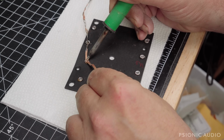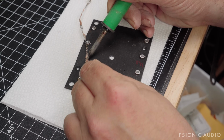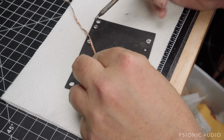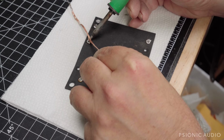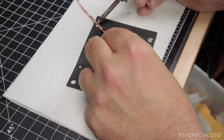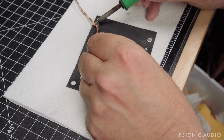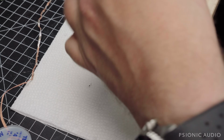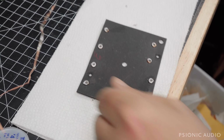People always comment that, wouldn't it be faster just to replace the fiber board, the old bias board or whatever, with the new one? The answer is almost never yes. The answer is almost always no, because this is not something that most companies carry for a 60 through 62 Deluxe like this. And even if they do carry it, there's no guarantee that all the holes are in the exact same location. Certainly no guarantee that the drill holes are in the same location.